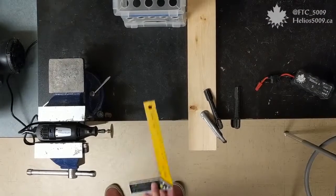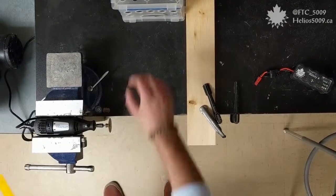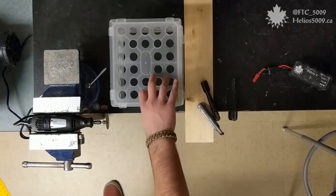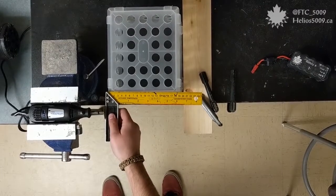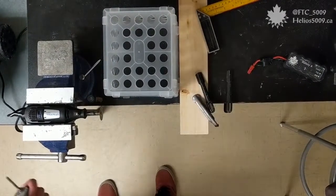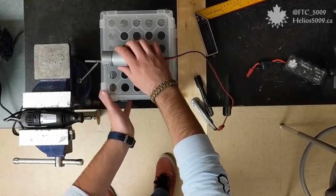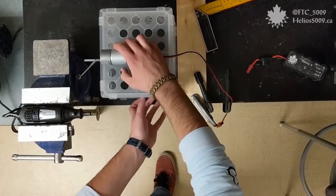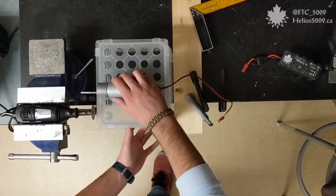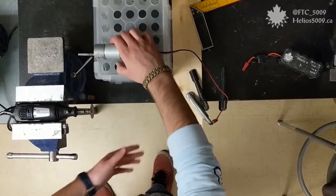So this is how we've set it up. We have our straight edge here, which is square to the table. This box will ride along the straight edge, and the edge of the box is square to the Dremel blade. We'll have the Dremel running and the motor plugged into a battery, up against this edge of the box. When we pull the box towards the straight edge and it reaches the Dremel blade, we'll cut all sides of the shaft to create a slot for the snap ring.